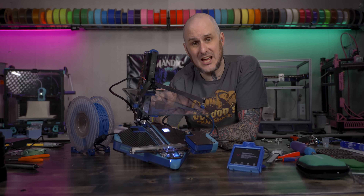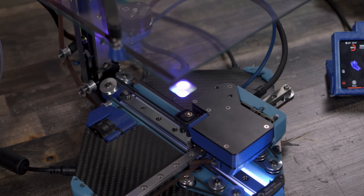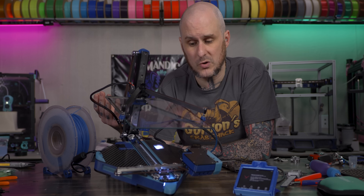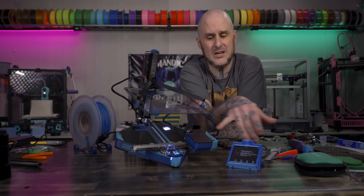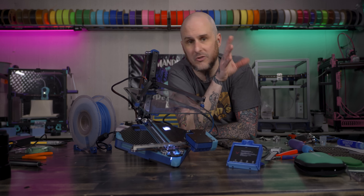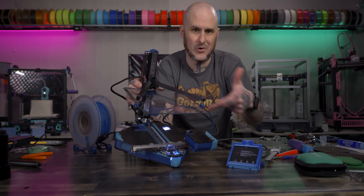There are a handful of LED lights in here — two neopixels in the front of the Y axis area, and three on the MCU board shining up through the top panel — for status indication, additional light on your print area, or whatever you want to program them to do. You can also move the tool head out to the front corner of the bed for easy access when working on it: changing out your thermistor, cleaning out a clog from your nozzle, whatever you might need. And you can easily pop the bed out of place to get even further access in there.